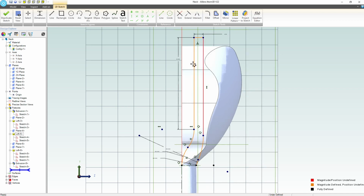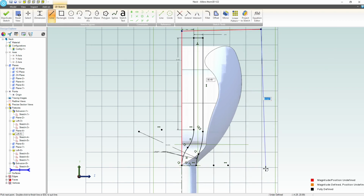0.575 should be fine. 0.75 kind of drop should be a good amount so the strings come down. And then what of this, right? Well, I know that I want this center point and this arc end to be horizontal. And now we're fully defined. Same rationale as before. I'm going to bring this up, around, down, right? This is just kind of taking the place of a Boolean.